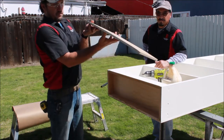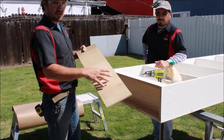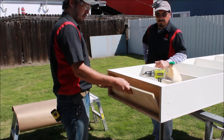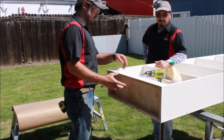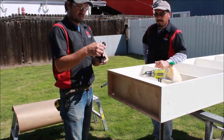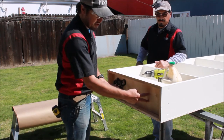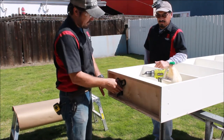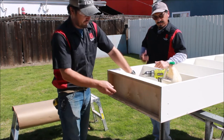In order to do that, we're going to take this piece of half-inch plywood, glue and screw it to the bottom of here. We're going to apply glue, throw it in here, and add about six screws to suck it into the base. Then afterwards we're going to take this set of dolly wheels and throw them here in two places so it's basically gliding along the ground as it opens on the hinge pivot. Manny, you want to take it over? Sure.